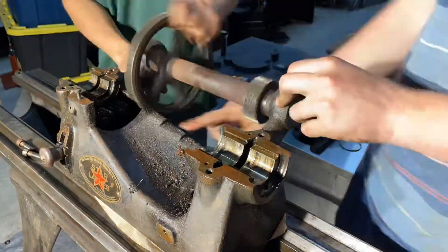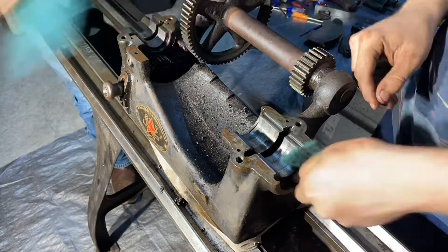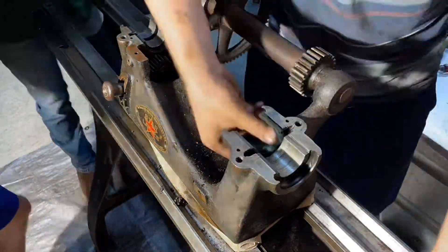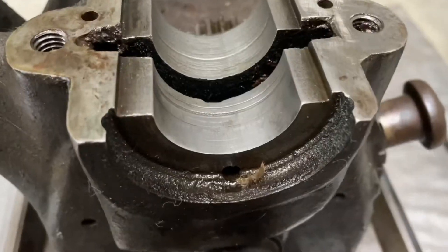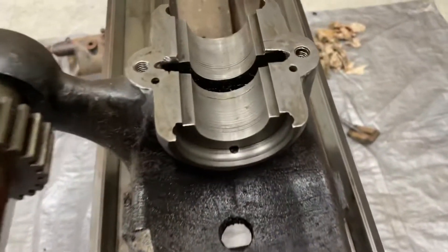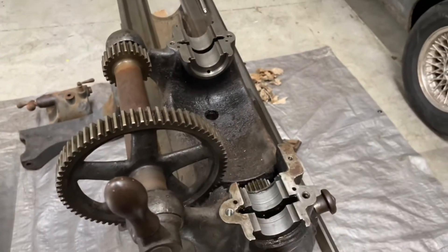We messed with the low gear contraption back there and just ended up wiggling it around and leaving it. Here we're using Scotch-Brite to see how much damage we have — it was a pretty sad sight. There was a significant amount of galling and tearing on the casting because they didn't use actual bearings; they used the direct casting as a bearing, and it probably wasn't oiled, with metal shavings or sand getting in there.